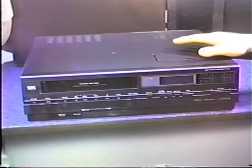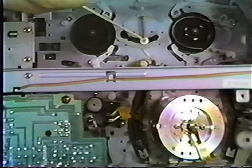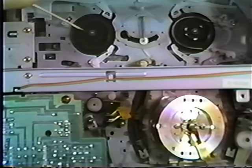The last unit we're going to cover is the Fischer type. We'll cover belt replacement and idler arm replacement. Lubricate this unit as you would normally. The top is off and we now have an overhead view. This is the idler — you'll notice this is a little bit different, the idler's on the underneath side. This is the brake. Take-up reel. And spring on the brake. Here's the spring on the idler. The brake once again, and the spring holding the brake into position.